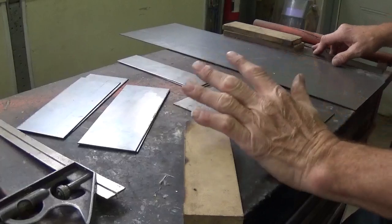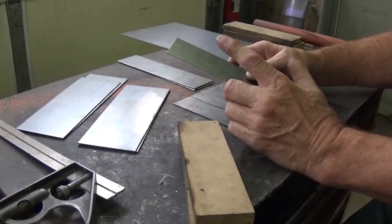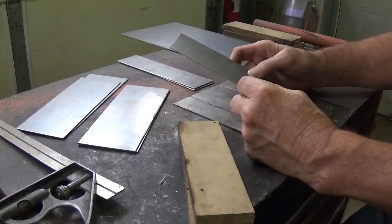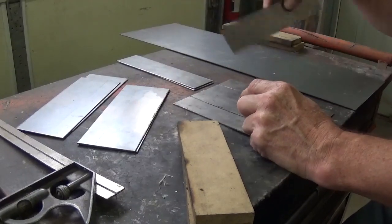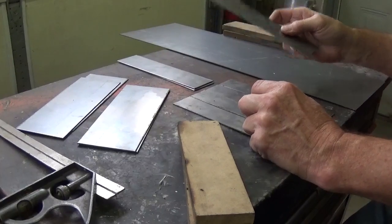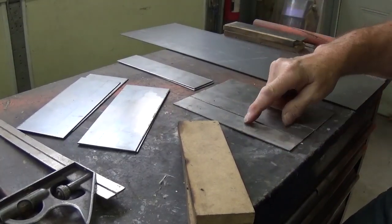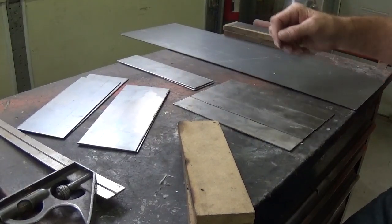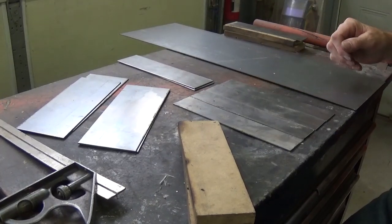You know, the one thing nice about using the cutter to cut these rather than a saw is that you don't lose that 1/8 of an inch of grinding when you use a saw or a grindstone. So this is actually what's left from a sheet of this. And the point is that you're not wasting anything, and your cuts are exactly right with that cutter, and you can just go ahead and weld them together. I really like having that cutter. Works very nice.